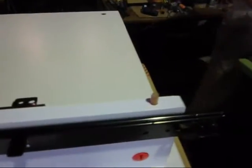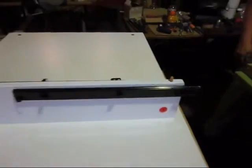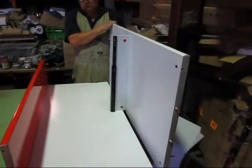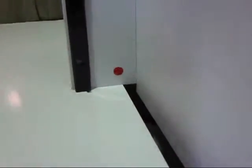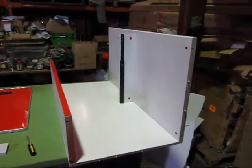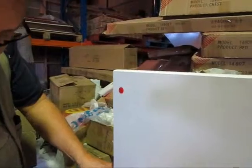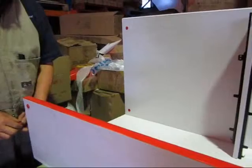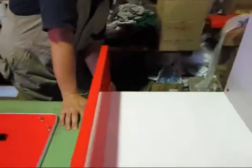Now on the top here we also put in one wooden dowel like so. Now we tilt back this piece in this position, and the piece that's previously been done — we're going to lock it in. Make sure the screw in there is actually positioned in and ready to lock in. Before we put it in, we also put in one locking device underneath there. Now the whole piece should be locked in this position. Next we're going to put in one locking device there, two in the bottom, and on the back here we also put one more locking device there. And we slide it out, we also put one at the bottom on that end as well.